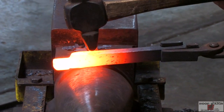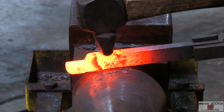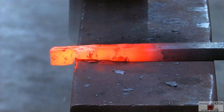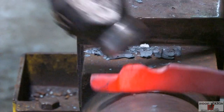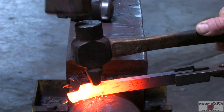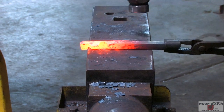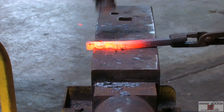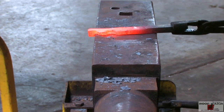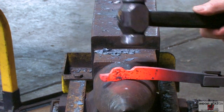We take just beyond the high side of the horn. Now we come in here and flatten it up. Then we come in and we're making this round the whole time. Just going to get rid of some of that material, push this back a little bit and push this in. We're making a round circle for that rivet — that's our boss.